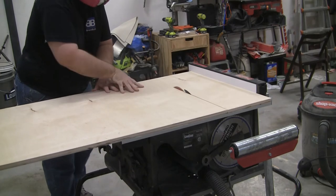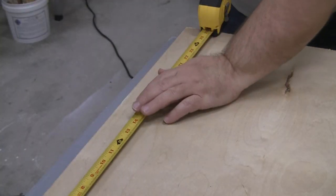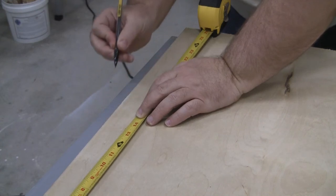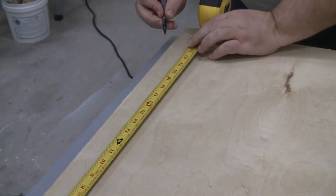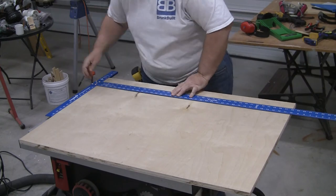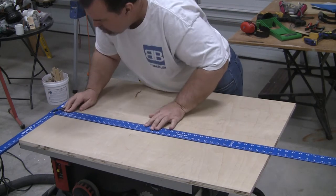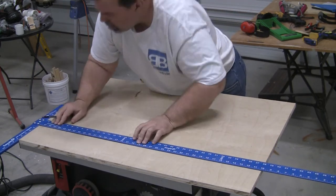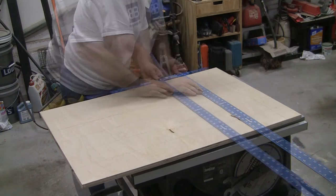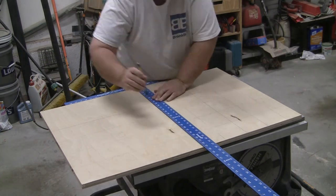The size of yours will be determined by how many slots you have and the size of your disc. Carefully mark out across the bottom of the board where each slot will be. Be sure that you leave enough room in each slot for the disc, plus the thickness of the pegs and the width of the wood you'll use for the landing chutes, as well as a little wiggle room — for me this was adding one half of an inch to the width of the disc. Once you have these marked, use a T-square or straight edge and draw out the grid on your Plinko board.